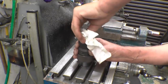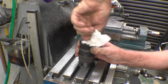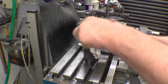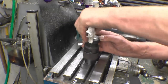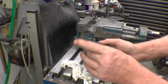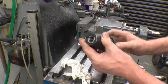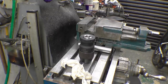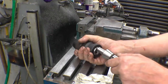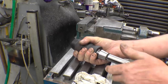Make sure in there it's clean — really clean. No oil, no grease, nothing. Make sure the chuck's backed off so the jaws are protected behind the collar, chuck fully open like that. So that's nice and clean and dry — push it in, turn it, and you can feel it wanting to seat. You can feel there are no nasty burrs; it's actually trying to tighten up there, so I'm going to leave it like that.